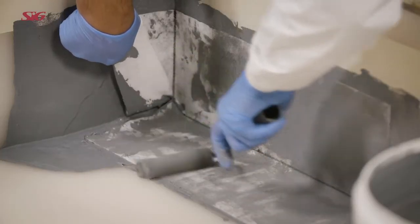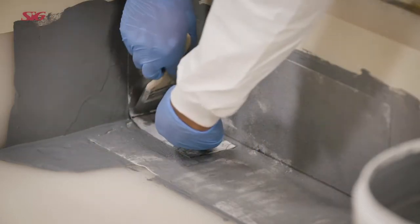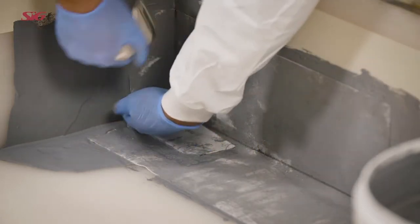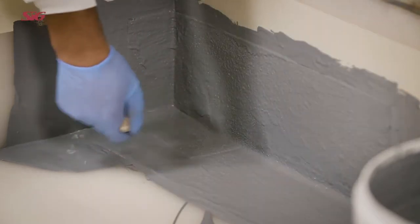Make sure that there is a layer of liquid between the folds of the fabric. Embed the fabric into the coating, making sure there are no creases and that no air is trapped beneath it. Apply the top coat and leave to cure.